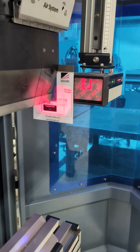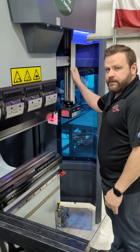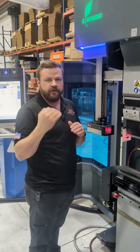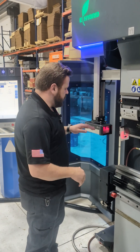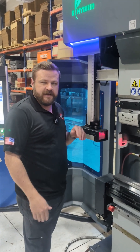Typically you can see if it's straight at this point. Sometimes you may have to adjust these actual arms up and down. So after you check your laser and you see that on the receiving end you're too low, too high, too forward, too back, or off left and right, you can come in and make adjustments on these lasers to properly line it up to the receiving end.